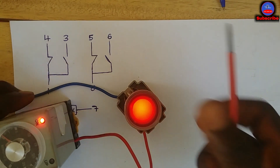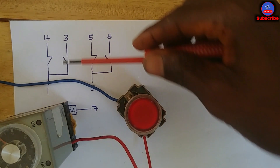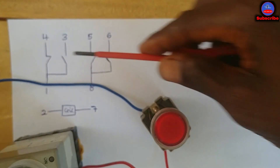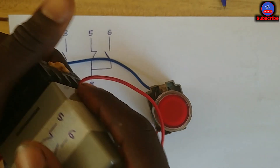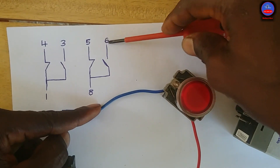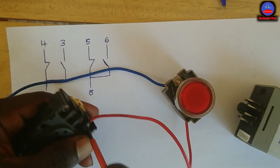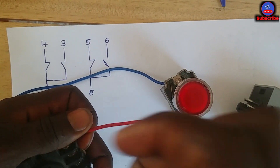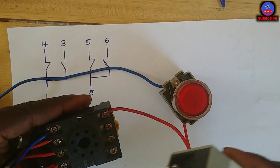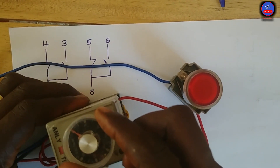As soon as I turn on the breaker, the light comes on — because this contact immediately opened the normally closed side and closed the normally open side, which is a normal relay action. When I turn off the timer they go back to their normal state. Now let me move the indicator light cable from pin 3 to pin 6 — that is the timing contact. We'll set the timer to 20 seconds.